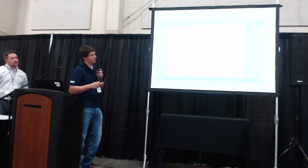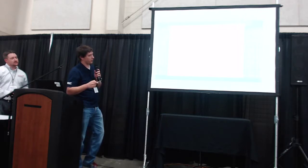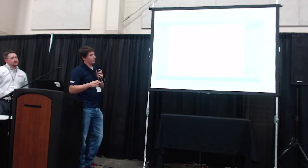And they usually will put your job number. And they'll often put the mix design number or what type of mix it is. And right here, I'm not seeing that it's a 1/2-inch mix, but that's something that they should put on there to verify that you're actually getting the mix that's specified for the project. But you can see that it was handwritten. You've got a stationing, a little station range. You've got the time it was delivered at 8:58 and the temperature that he measured from that truck. So that truck was 305. That was what the asphalt temperature was.